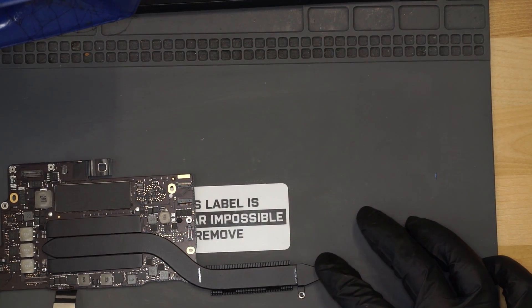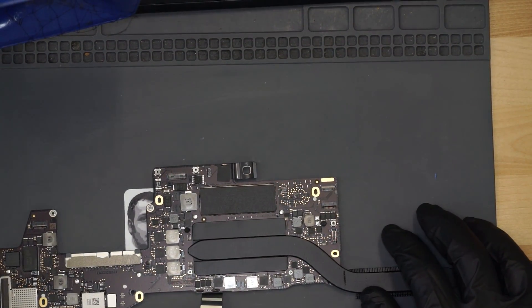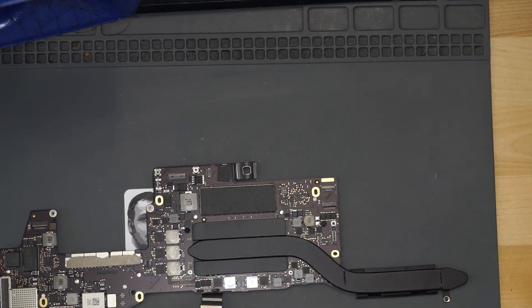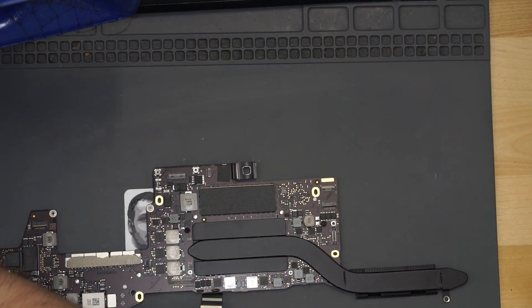I'm not finding anything obvious on here. So we're going to turn on the power supply that I fixed the other day. Now I'm going to put that on my board — I'm going to inject one volt into PPBus and see what comes out.